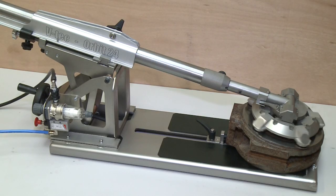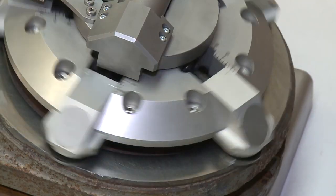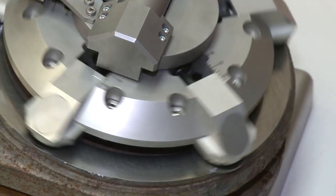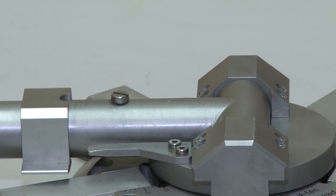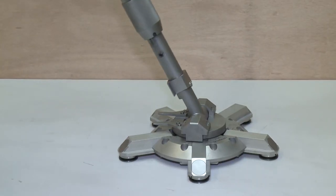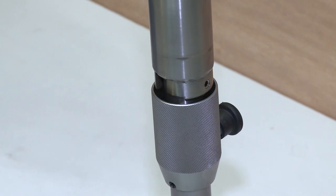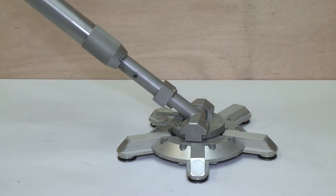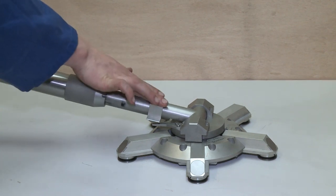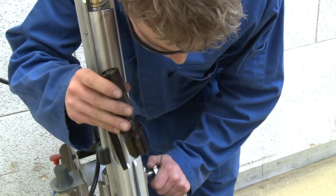The standard included wedge bracket is used for very easy positioning and refinishing of the complete range of gate or parallel slide valve wedges. The flexible connection between the Orbit arm and drive head makes it easy to switch from the vertical position used for gate, parallel slide and check valves to the horizontal position used for globe and safety valves. The arm construction gives sufficient movement to prevent any influence on the seat angle.